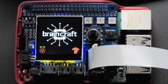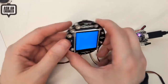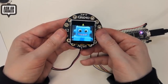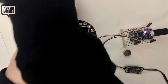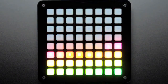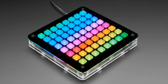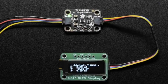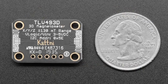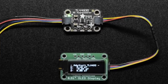The TFT Gizmo is an all-in-one display plus audio output plus STEMMA connectors for servos and NeoPixels, letting you add a beautiful 240 by 240 display and speaker driver to your Circuit Playground Express. The plastics kit for the NeoTrellis 8x8 lets you plug in your favorite Feather, grab four NeoTrellis boards and some elastomers, and build a beautiful 64-button grid with NeoPixel LEDs behind each button. The star of today's show is the TLV493D three-axis magnetometer — not good for Earth's magnetic field sensing, but great for detecting a magnet from a couple of inches away and giving you X, Y, Z coordinates for magnetic positioning.